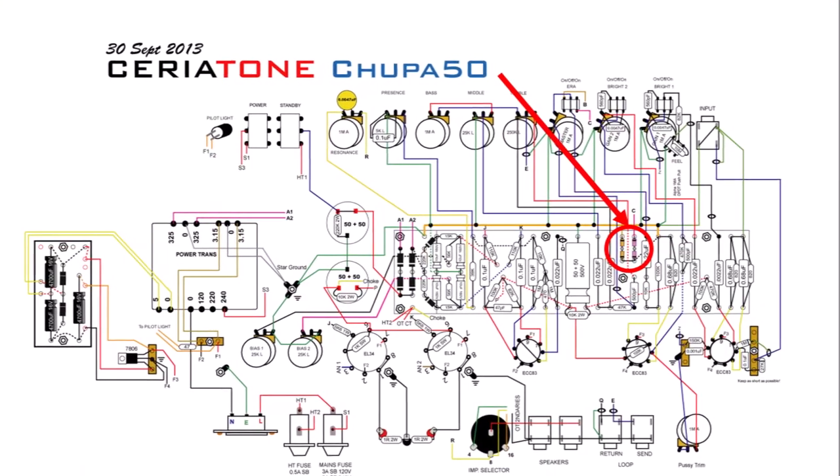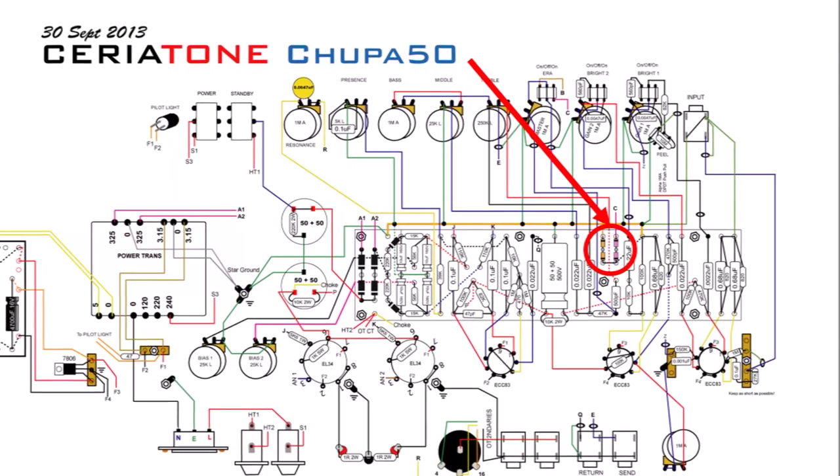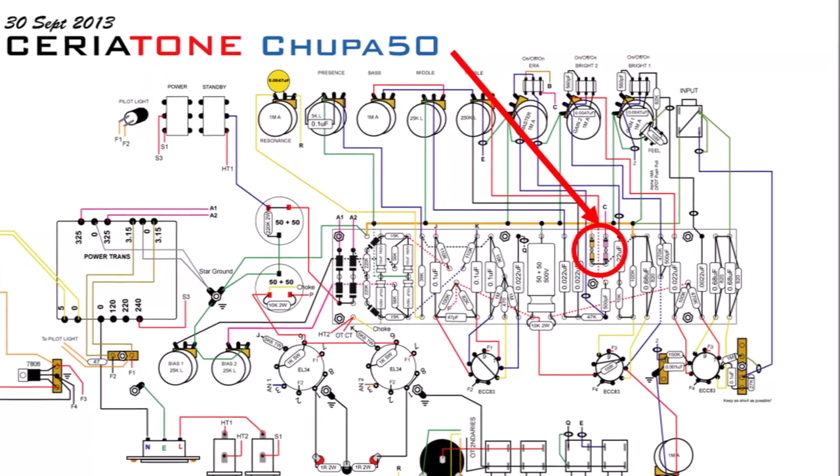On my last episode of Explained, I was demonstrating how this gain switch, which is a clipping diode mod between the preamp and power sections, also known as a Jose mod, does something kind of similar where you limit the headroom after the preamp section. You start distorting more because you're cutting off some of those peaks. Things get a little nasty, some of the dynamics disappear, things become more compressed and squashed and kind of nasally in that way. And as a result, you cut your output volume as well.